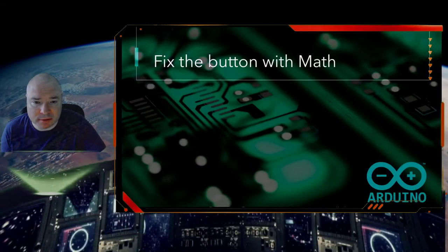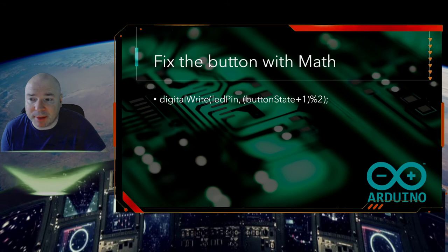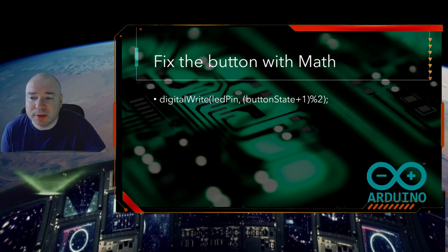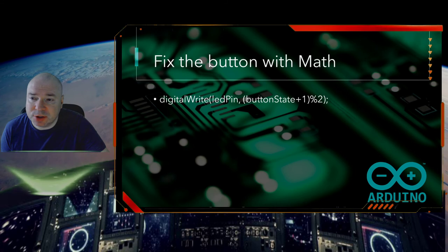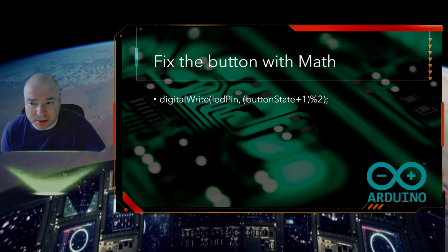So for our math here, we're going to put in this line of code, and that will flip the button. Now, how's that going to flip the button? Well, let me show you. Our digitalWrite is going to be the same. Then we're going to have our LED pin storing our variable, and then we're going to set whether it's high or low. So the way this is going to work, if this has a value of 1, 1 plus 1 is 2. The remainder of 2 divided by 2 is 0. So that, in effect, switches the button state from a 1 to a 0.